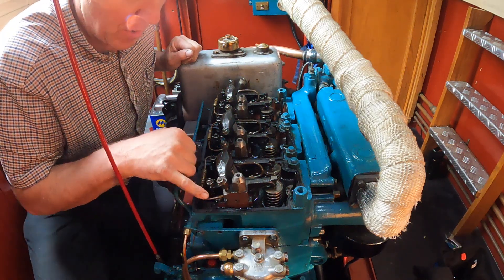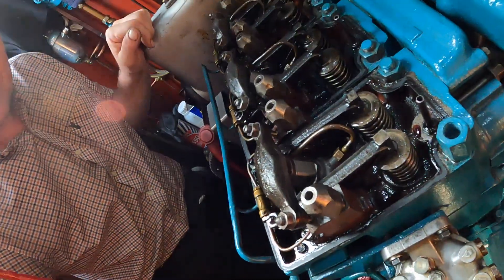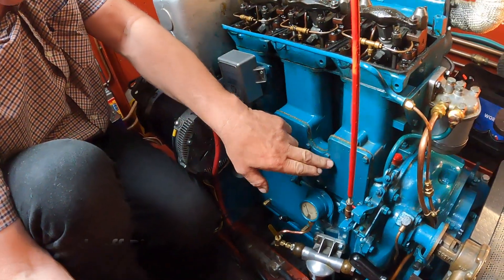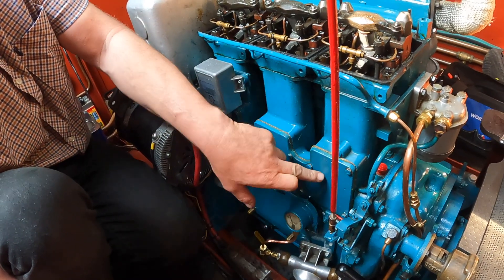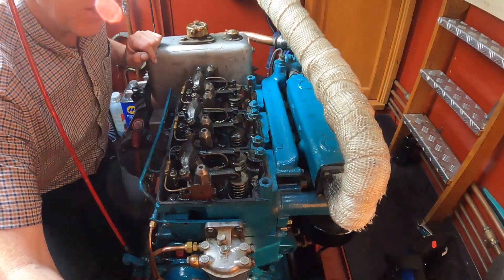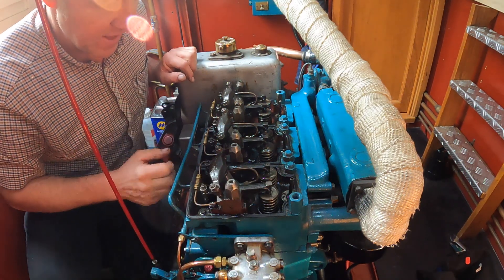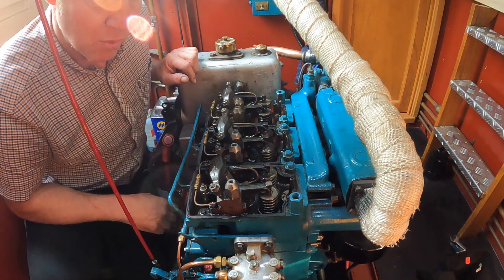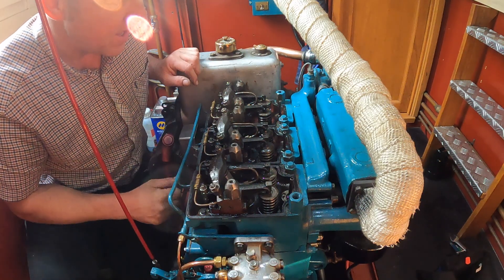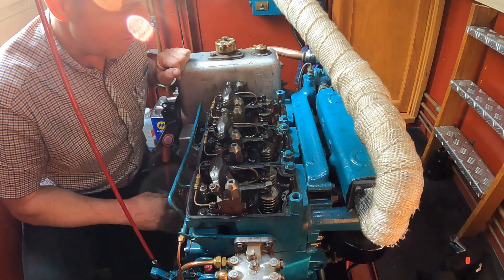You've got these little copper pipes on there — these are oil feeds that feed up to the top. The injectors are tucked in here. The injectors are just tucked in the side here — these are the injector pipes, they run down the side of the engine. This side plate actually comes off down here. And then you've got the individual injector pumps in here, and the fuel return off the injector pump. I've had this trouble — and it's a common trouble unfortunately with Listers — that these copper pipes become cracked. Everything's vibrating a little bit; they crack around the olives where they're soldered together. The first sign of it is you start gaining oil on your dipstick — you're actually getting more oil in your engine. But it's not oil, obviously — it's your diesel leaking into the engine. Just something to keep an eye on.